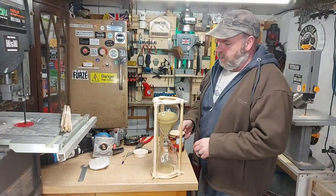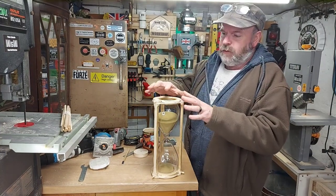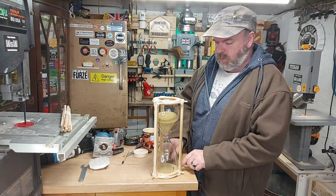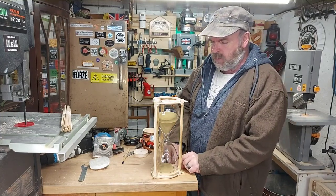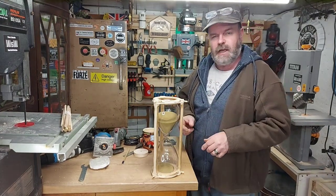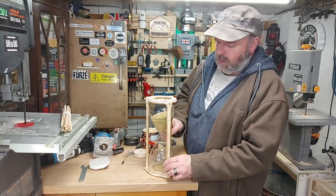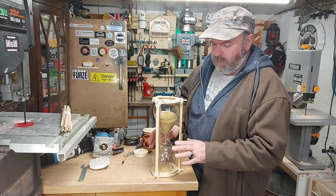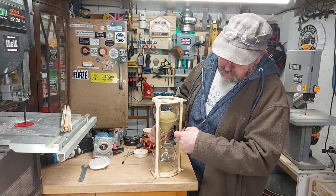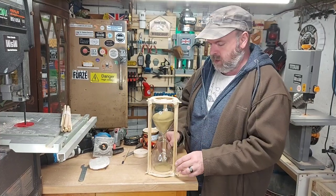Right, yeah, I can't believe how long it's been taking to do this. So I've got that glued up now. I've got tight, strong elastic bands going round top and the bottom, holding it all together. This is glued and doweled in, and then I'll trim them dowels off afterwards. So yeah, what I've done, I've waxed, because the wife wants it just a waxed finish. So I've waxed all the parts on the inside that I can't get to, and then I can finish this on the outside afterwards.